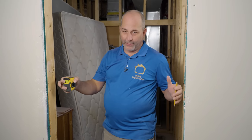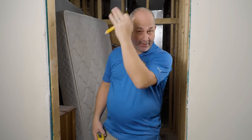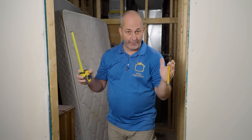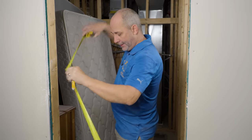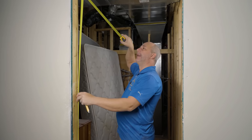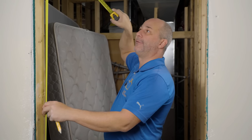I believe in putting in your flooring first and then putting on your doors and trim because it gives you a much cleaner look as a DIYer. I know that the trade pros will do the doors first and all the trim work and then do flooring last, but in order to do that you've got to have professional tools and jam saws and everything else. So my system is designed to help you guys get a professional look, and that means we're going to have to customize our doors. Now from the flooring up to the two by four, I'm 80 and a half.